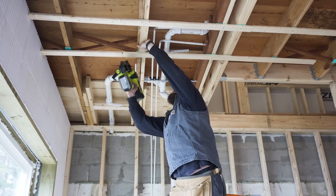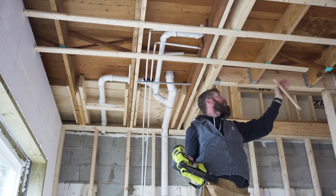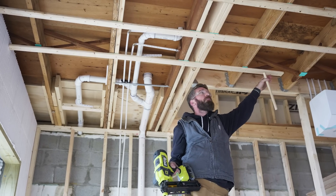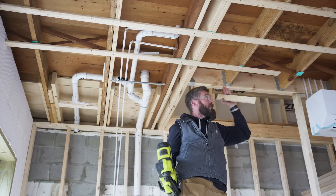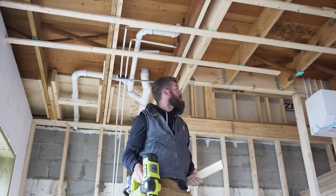Come down here, and there you go. We'll do that every joist span. Wherever there's a break — like at the end of this board — we'll be able to install a piece above it and simply screw those together, making sure those are nice and flat to give us a spot to hang our drywall nice and flat.